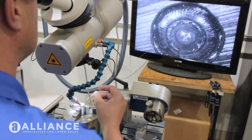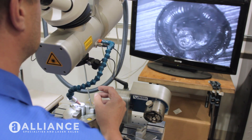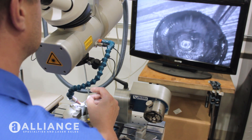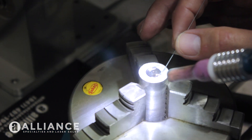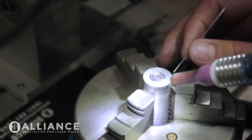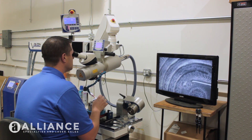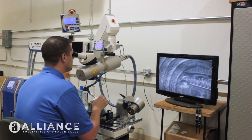There is a dimple here that you can see in the center that was too deep. And if you're wondering why I'm doing one pass with wire and one pass without, that's standard how we weld with the laser. We do one pass with the wire and move over approximately 50% and do another pass without, just to create a smoother, cleaner weld point for the next weld.